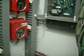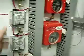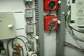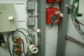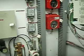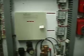If the controller fails and we're not here to switch over to this one, the level goes up and these pressure switches start turning on pumps, these silver ones. These two pressure switches operate this. If the pressure switches fail, if the air pressure system fails, if the controller fails and everything else fails, there is a float ball connected to a timer. When the float ball tips up, a pump starts. When the float ball tips down, the timer counts 5 more minutes and then shuts the pump off.